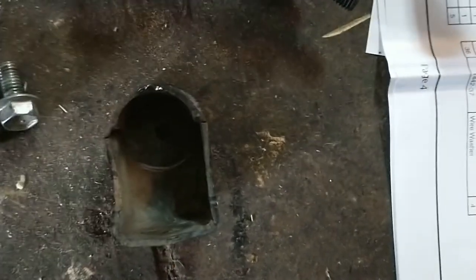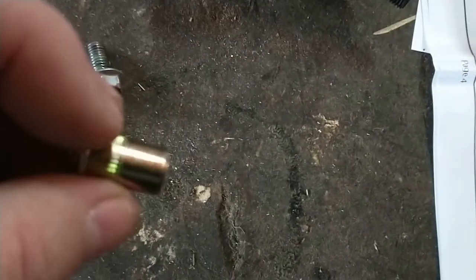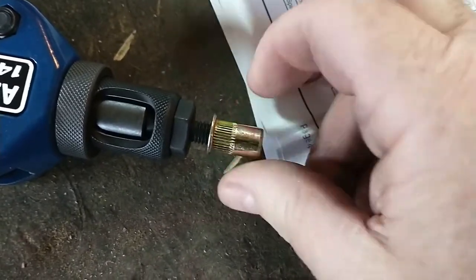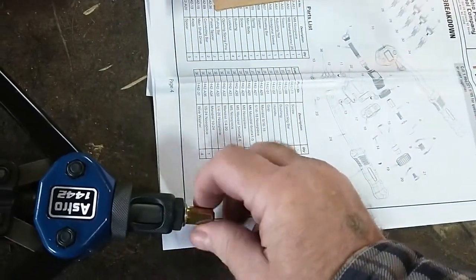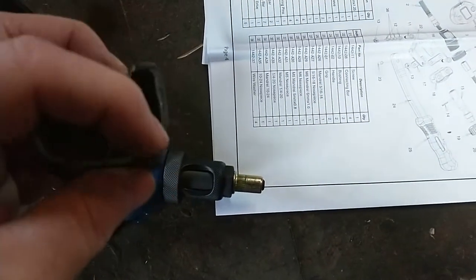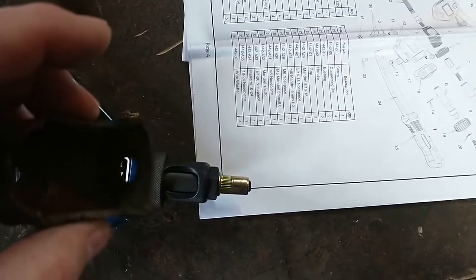So let me get this prepped — I'll get the hole drilled. I've got to find a bit to match that diameter. This is an M8 metric size mandrel on there, and there's a picture on there. You screw it on like that, then you start with the levers all the way apart, screw this down, and then you pull the levers together and it crimps down. The idea is we're hoping it's going to bite down tight enough through this metal that it's going to hold in place and I'll be able to get a screw through there.